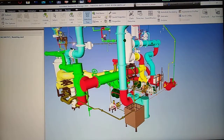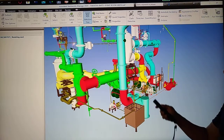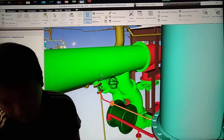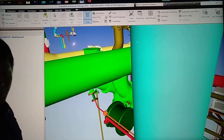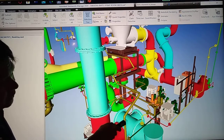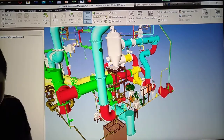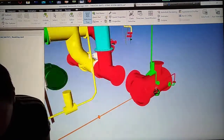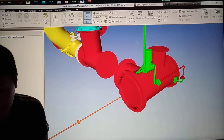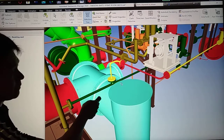For a clear view, looking at the 3D diagram: we have our ballast tank port side and starboard side, pumping out going to overboard. We have our sampling point going to TRO 1 or 2, and our chemical injection point on the port side and chemical injection point on the starboard side.